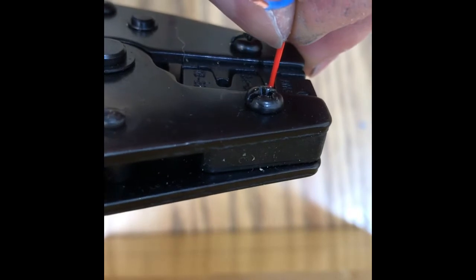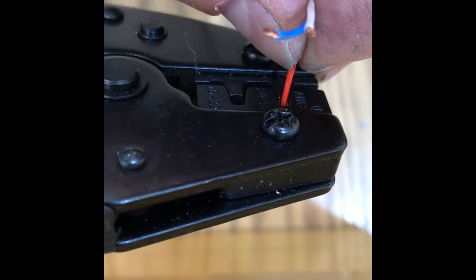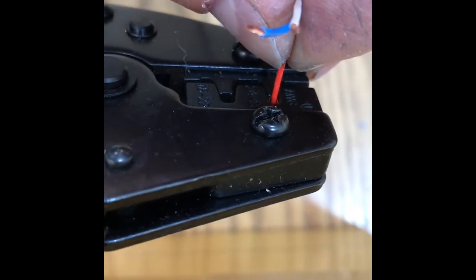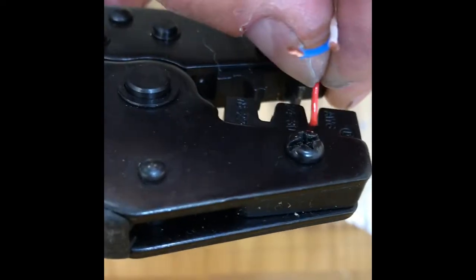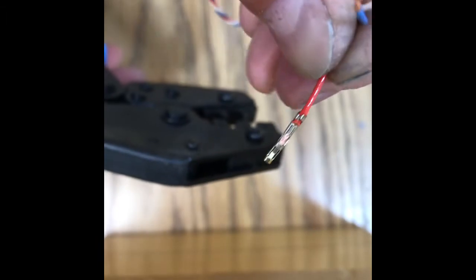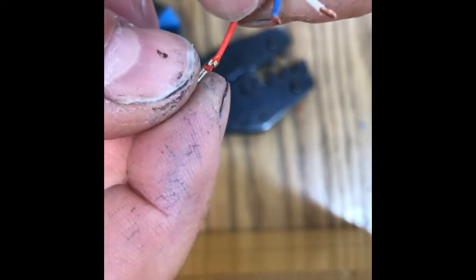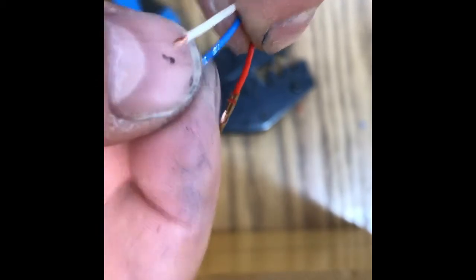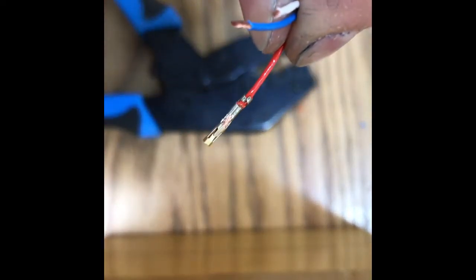Slide one of these in so that the insulation goes into that last part of the crimp, because you want it to hold the insulation and not just the wire. Pull it down, click all the way, then it releases — and boom, it's crimped perfectly. One thing to notice with the PowerBox wire is that the insulation itself is fire resistant or heat resistant, really lightweight, and the wire itself has really fine strands of copper. That's why we like this stuff — it works really well. Let me get the rest of these crimped on and then we'll put the connector together.